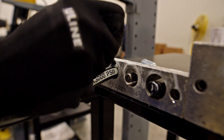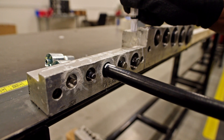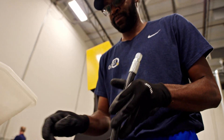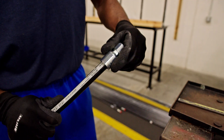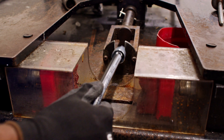We'll insert the hose into the proper depth gauge based off the crimp series and size and add a mark when it's fully inserted. We push on the hose and only when the white mark is fully covered the hose end is inserted properly. We've actually implemented a new tool in our hose room called the push-on stand. The push-on stand assists the hose professional in ensuring that the hose end is bottomed out completely on the hose.